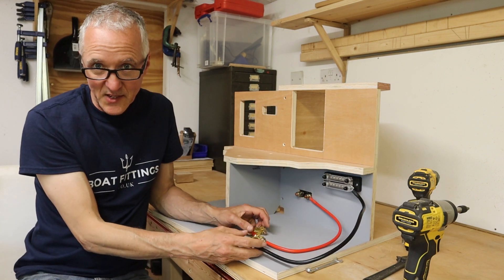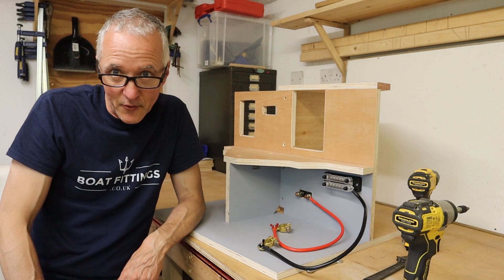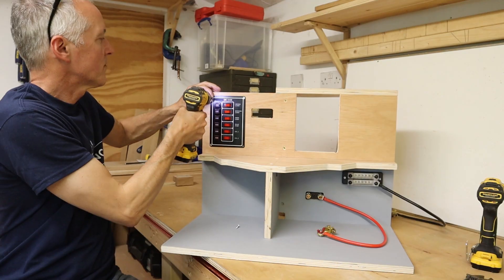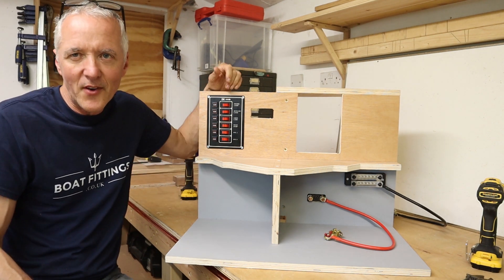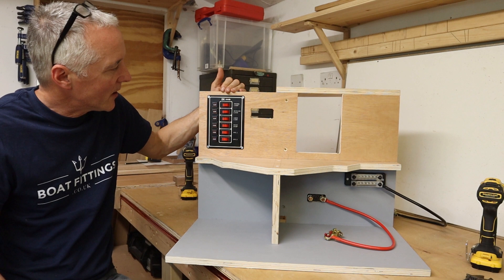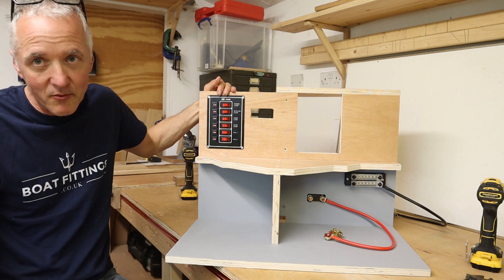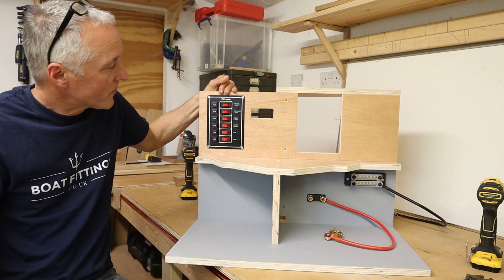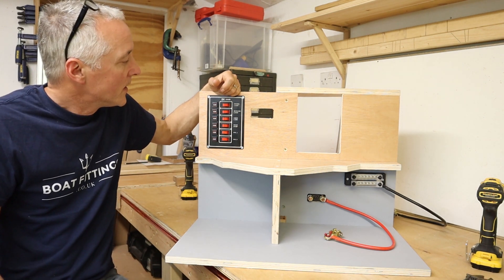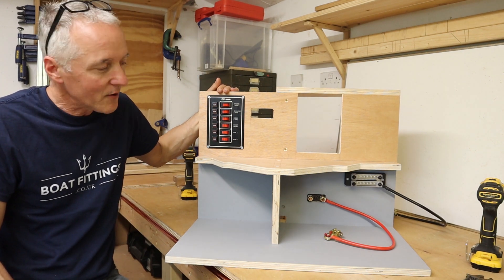Now we've got the key bits of our wiring and circuitry that go to the main battery, and we work outwards from these to the other things we're going to install in the boat. Next up will be the switch panel. Just to say on these switch panels — very few, if any, are really truly waterproof, so you've got to think about where to position it. On a sailing cruiser I'd expect to see it inside the main cabin, just inside so you can get to it easily from outside, but not in the cockpit where it's going to get splashed. Think about ease of accessibility but keeping it high and dry as far as you possibly can.